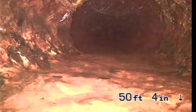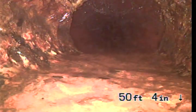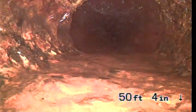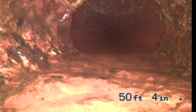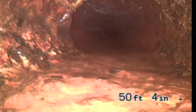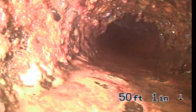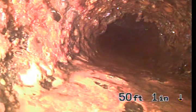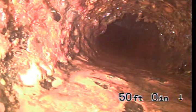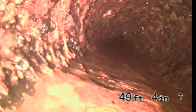So it's at the end of its life. Does that mean it's broken and bad and not working? No, but it is porous and rough, and anything that's not biodegradable can get caught on it and build up and cause a dam. You can also see that the pipe is not round — the bottom of it is flat, which means there's a lot of rust and sediment. Also when you look at it, you see these stalactites on top dripping down, which usually means the pipe is thinning and roots are trying to grow through. I don't see any major roots growing in this pipe, but you can see that this pipe is old.